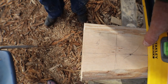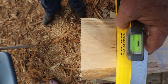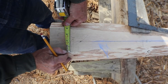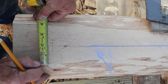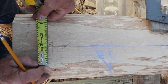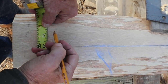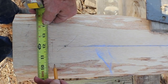I'm going to check this again — put my level back up here on the shoulder mark, which will be the control, and look to see if my bubble's still in the middle. It is, so that lets me know I didn't bump anything out of whack. I can get about a three and three-quarter inch width tenon on this end, the butt end. This is one of my smaller joists — probably the smallest I have — so I'm going to bring my tape out to twelve inches, set that right on the center line, and mark the inch and seven-eighths.